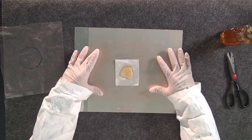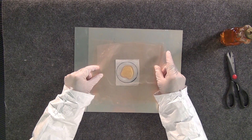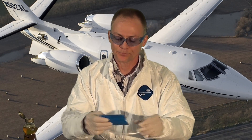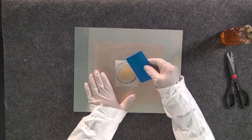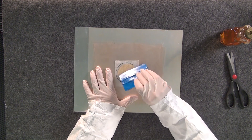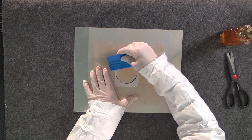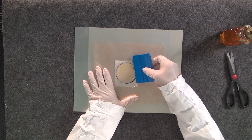So what we'll do is place the adhesive on the repair ply. You can see that the non-bonding film is quite a lot larger than the actual repair ply because we're going to squeeze this extra adhesive out of the area. So we take a spreader — what some call a bondo spreader — and we begin to work the adhesive into our repair ply. I just want to get that adhesive kind of widely distributed, filling that circle first before even considering going outside of it.